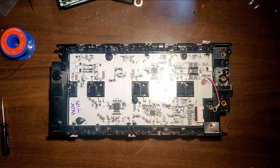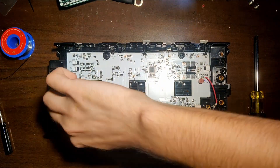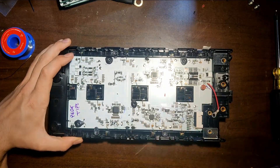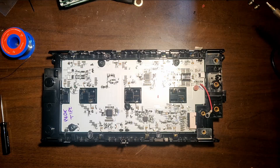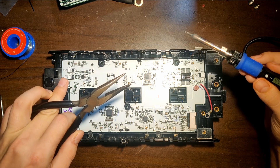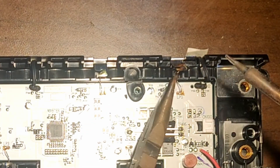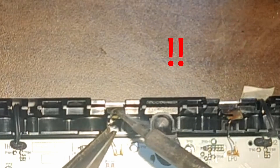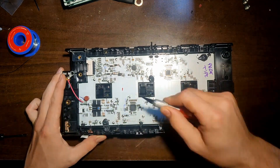These batteries come with integrated circuitry, which was probably wired to a central unit that managed things similarly to a BMS. Unfortunately, this circuitry is useless by itself, so the best way forward is to remove it. I'm first removing the black gunk on top of four screws in order to take them out. Next, I chopped off the five wires, which were connected to temperature probes. You'll see I'm pointing at a metal tab — there are 14 of these total, one tapped into each group of cells plus one at the main negative. Each one has a connection to the circuit board that needs removed. Rather than just chopping off the connecting wire, I opted to completely desolder each tab, which made soldering on the BMS wires much easier. A word of caution though — many of these tabs have stored tension, so when you desolder them, it's fairly likely that molten solder will flick right off. Once that's done, the black gunk is still holding the board to the chassis, and it should just pop right off.